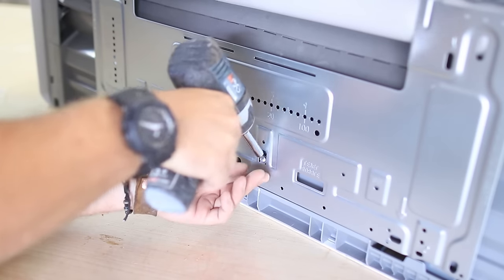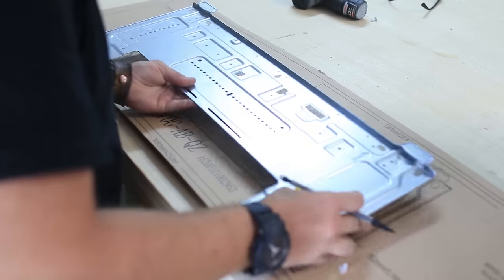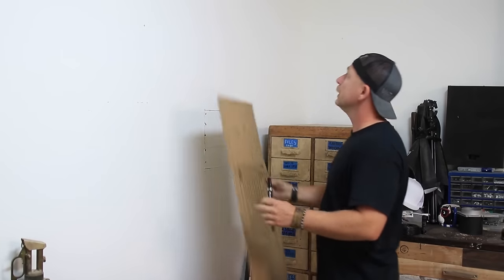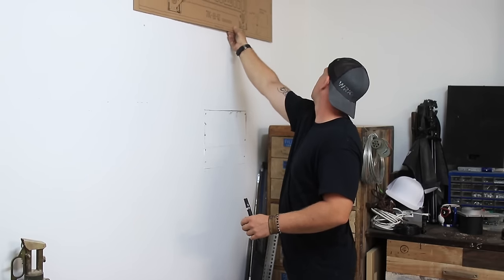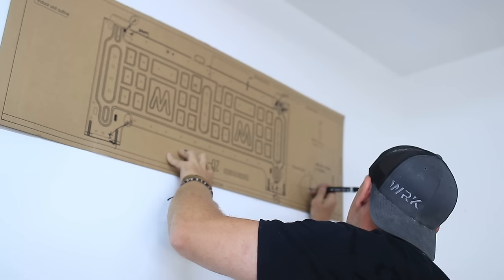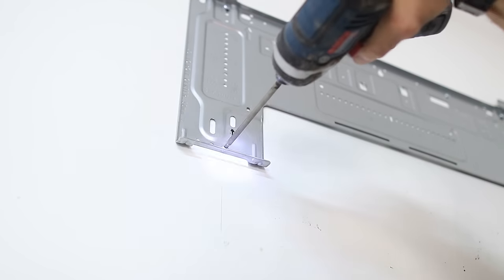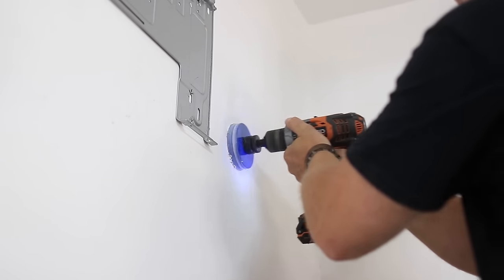Next, I unpacked the air handling unit and took the back mounting plate off so I could put it on the provided wall template and figure out the screw locations. I marked them on the template and used the punch to put little holes in it so I could transfer those marks onto the wall, which is super easy because it's going right in this corner. Then I leveled out the mounting plate and secured it using the provided screws. Using a hole saw, which also came with the unit, I drilled through the drywall — this is where the line set is going to go outside the building.